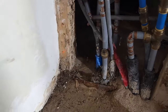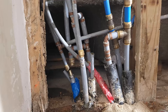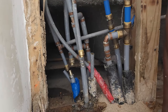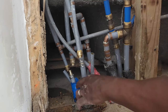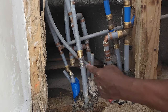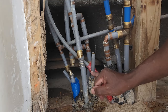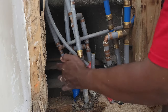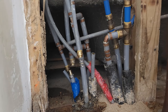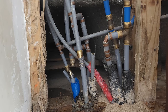We got the leak stopped, and as always, it's going to be the last one you cut that's the one that's leaking. Thought it was a three-quarter inch with the amount of water coming out, so we cut the half-inch back here, did the two three-quarter lines that run down first, and then that last half-inch. This is the line that runs down — this is the one that's leaking, most likely, since the leak is going that way. Once I put everything back together and connect those back up one by one, I'll check the meter as I connect them to make sure we don't have multiple leaks. Once we capped this one off, the meter stopped turning and the water stopped running.